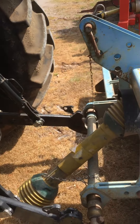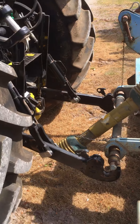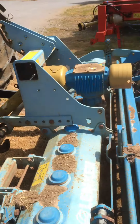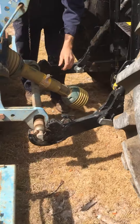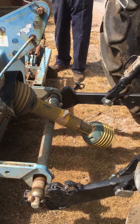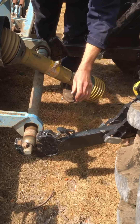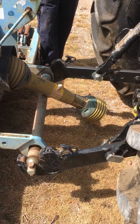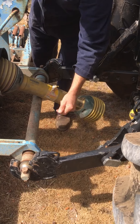Alan is going to go inside the cab because he's lined up. It's just double checking to make sure those arms are lined up, making some minor adjustments, and lifting the lower links into position. Lock them in place with clips.